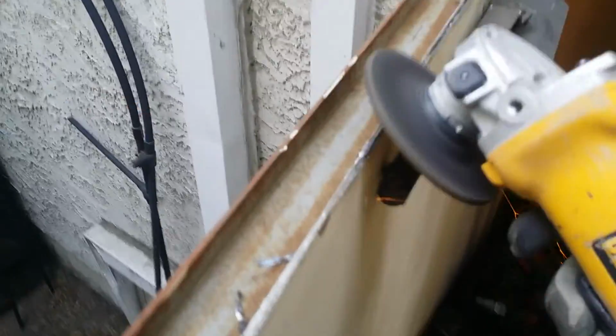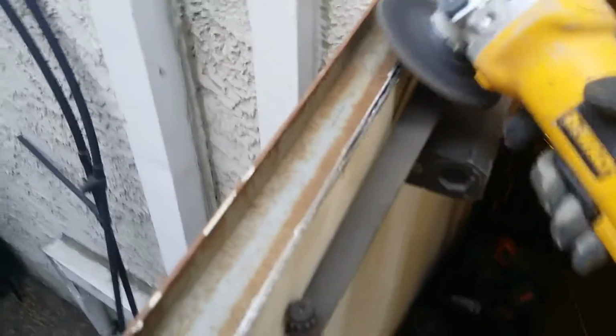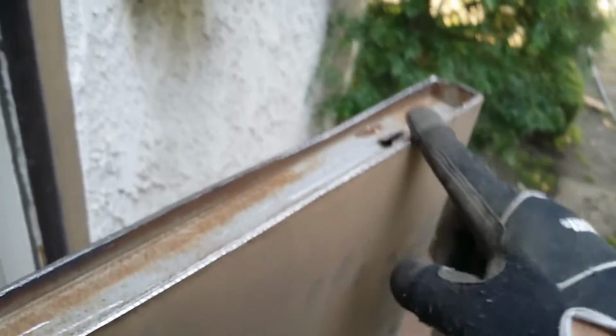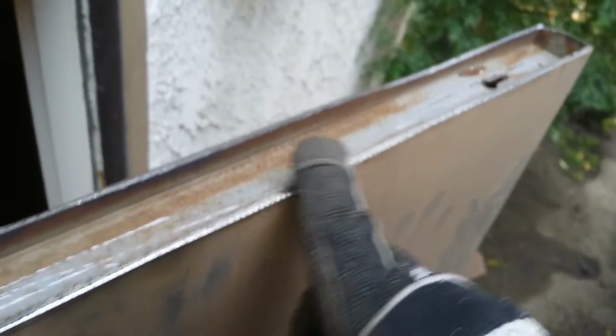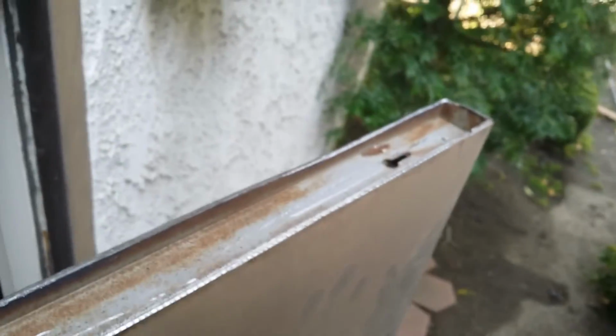And when you tell the customer, hey, look, I can fix this thing for a couple hundred dollars or we can replace it for a couple thousand, they will be ecstatic with your results. Now, since this outside edge isn't really hitting, I just use the grinding wheel to take it down about 1/16 of an inch, so that way this thing continues to settle. At least it's not going to start rubbing in a month.